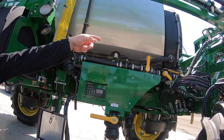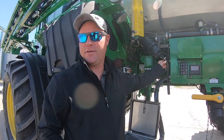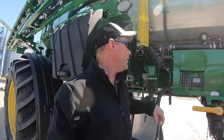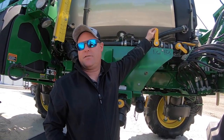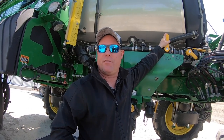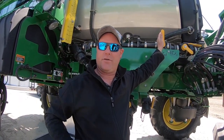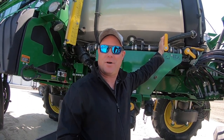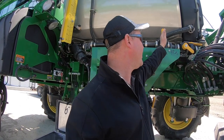There's a 110-gallon rinse tank on the back of the main spray tank. This is a 50-mesh straight-line filter before the flow meters — important to keep it cleaned out. Following through: flow meter one, flow meter two — flow meter two has a tap on it. For high flow rates, anything over 100 gallons per minute, or basically any 40-gallon-per-acre jobs, you'll be opening the dual flow meter.